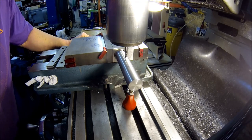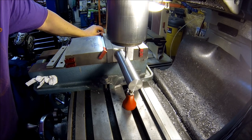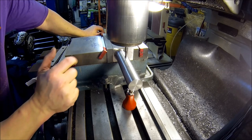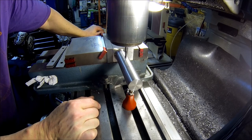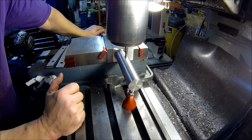So over at the mill, I could just weld on the north, south, east, and west directional letters, but what fun would that be, right? So, plan is just go ahead and mill some slots in it like I did the top of the stub shaft for the German Shepherd and the Arrow. Just have it held in a 5C collet block, which would be easy.